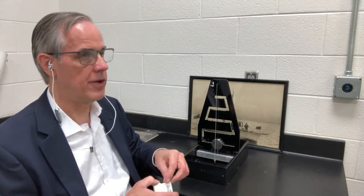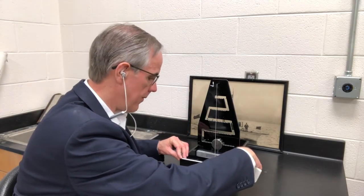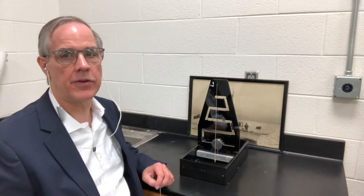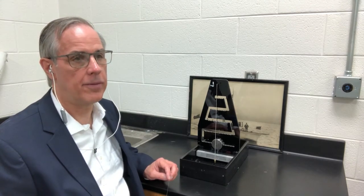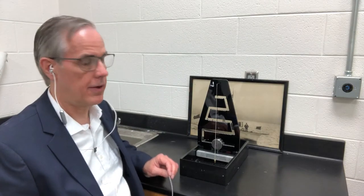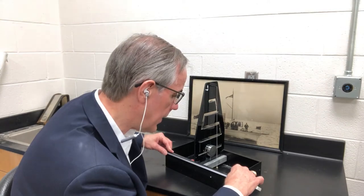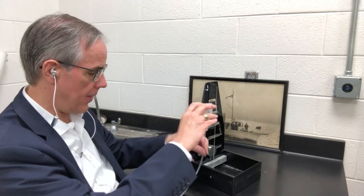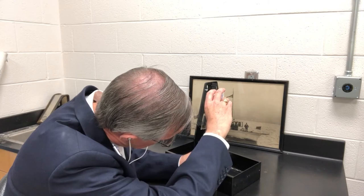Let's go ahead and take some of the first measurements. You need to look at my write-up on this and notice the variables. First, the beam of this ship — and the beam of this particular craft is about 20.3 centimeters. I'm going to record everything in centimeters; I strongly suggest that you use CGS for this, not MKS. You will have no end of problems if you try to use MKS. The length of this ship is about 36 centimeters, and the total distance from the bottom of the hull to the gunwale is about 7.6 centimeters.